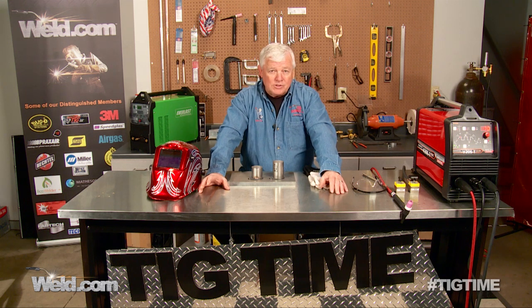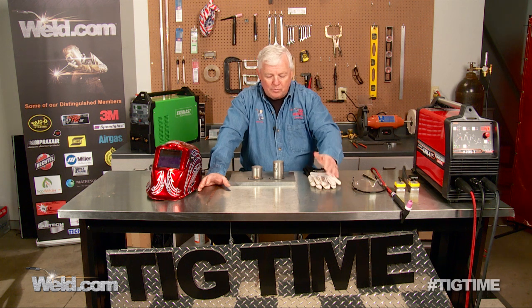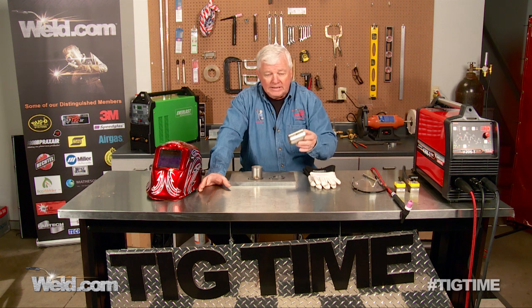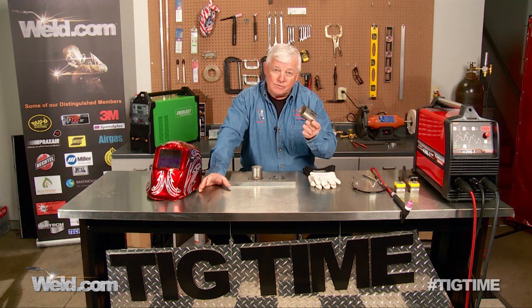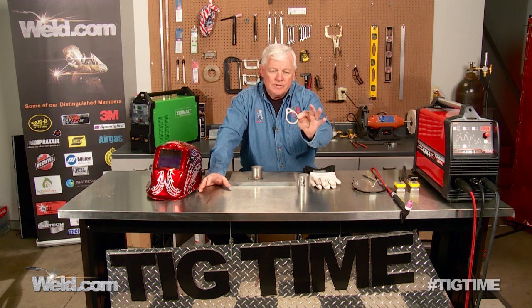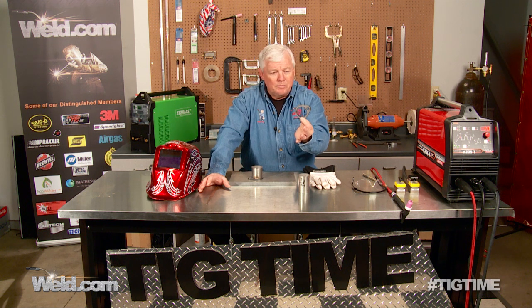One of the beauties of this is because you're not reaching melting temperature, you're not shrinking and distorting as much. I want you to think about that when we start to weld these two materials. This one in particular is stainless steel — it's just 304 stainless or 304L. It's got a melting temperature of 2,600 degrees Fahrenheit. Then we're going to weld it to this little piece here that's already been plasma cut, and this is steel — it's just mild steel, and it goes on a header or an exhaust type of component.